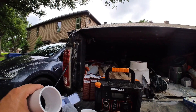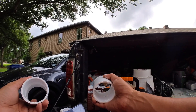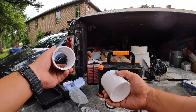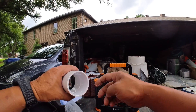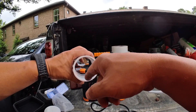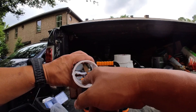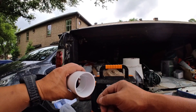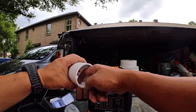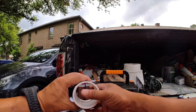Hi everyone, in this video I'm going to show you how to create a repair coupling. This is a two-inch PVC schedule 40 pipe, and one of them has already been done where I have shaved off the middle partition. As you can see, there is a middle partition, and that is used so that when you put the pipe in on both sides you have something you can feel — it stops the pipe. You have to go in approximately about an inch or an inch and a quarter for schedule 40, so that you have enough cement adhesion around that area on both sides.